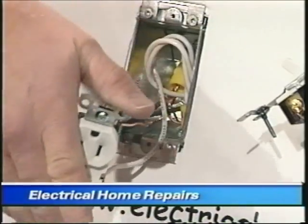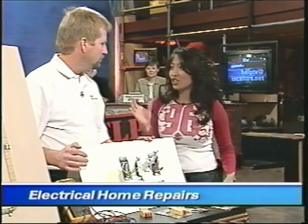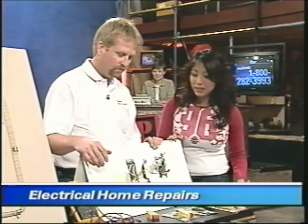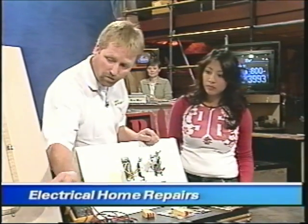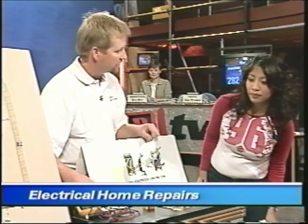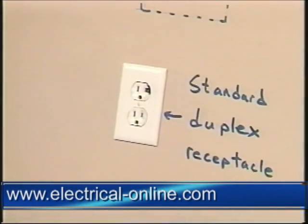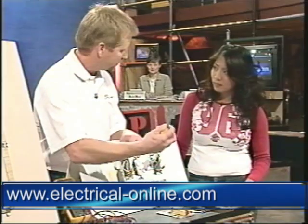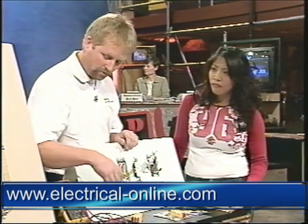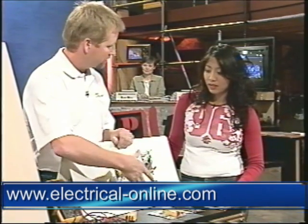In your house you're only going to find red, black, white, and green or bare for ground. Now let's talk about electrical devices and changing them. For receptacles, there's one broken on the board here, and we could be changing that because it's a safety hazard — your devices will start to fit loose and could fall out, or you could electrocute yourself pulling it out if it's loose and you grab the prong. To replace a receptacle, you'd pull it out and see something much like this — after making sure the power is off.